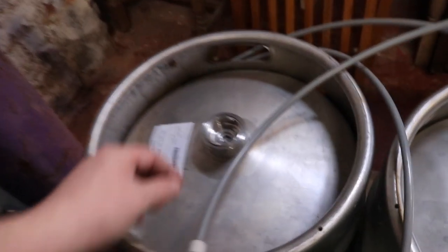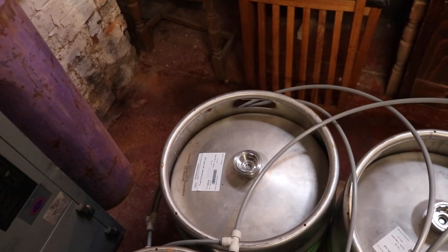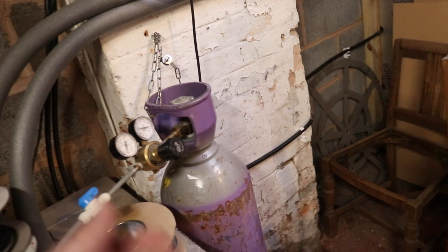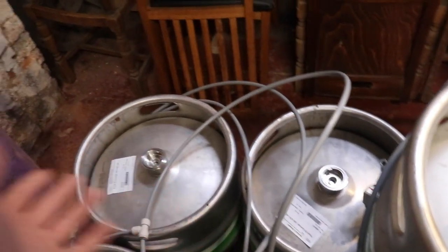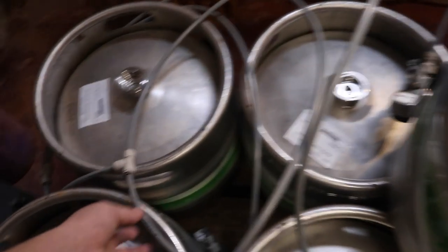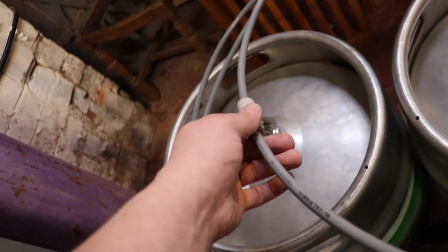So you'll no doubt want to know how I carbonate the beers that we put in keg for the pub. Because we just use these in-house and we're not sending them out anywhere, what I generally do is leave them connected to the CO2 for a week or so, and depending on the ambient temperature in the unit is what I'll set the PSI to on the regulator. So this time of year, middle of November, we generally average between 10 and 6 degrees centigrade on an average week, and I want to put about 2.5 volumes of CO2 into these beers. So I'll set my regulator between 12 and 16 PSI. I think we're on about 15 at the moment. And then I've got them all daisy chained, all these connectors. We've got the outlet plugged so we can't have any beer coming out of the keg, and these are all linked together with these John Guest push fittings.